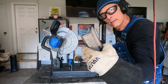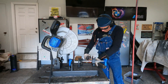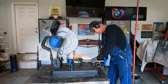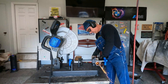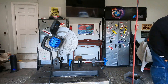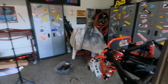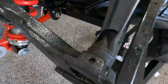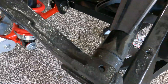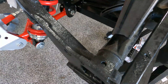I got that side sanded, now I'm working on this one. See how that fits on there real good? It obviously can be welded on the other side, but this tube is round, so now I'm going to mark it and cut the back side off.